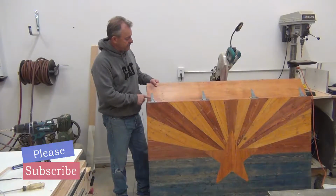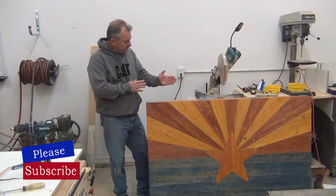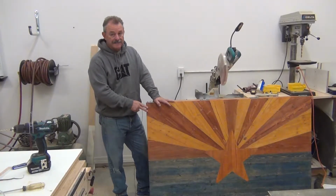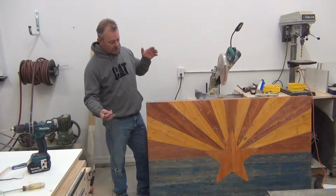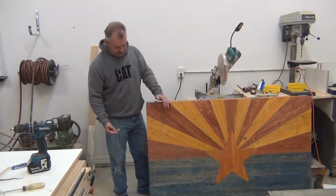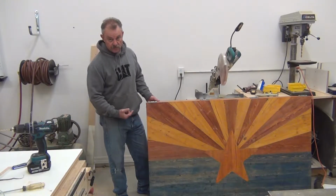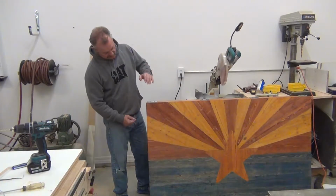First off, these gate hinges were in the wrong kind of stress layout position. I need to use a piano hinge here. The door itself weighs about 70 pounds, but if you look at it mechanically, or physics-wise, for every foot it goes over, that weight multiplies. So I figured there was basically about 200 pounds of force right here. And those shocks, which were only rated about 80 pounds apiece, were making it sag.